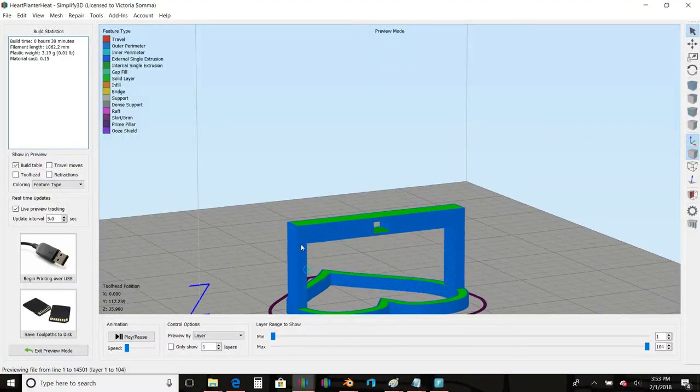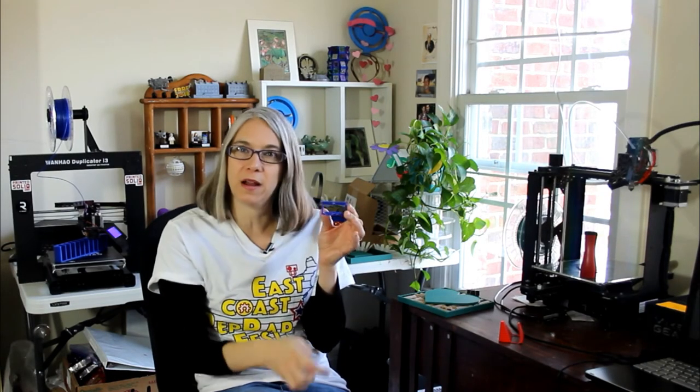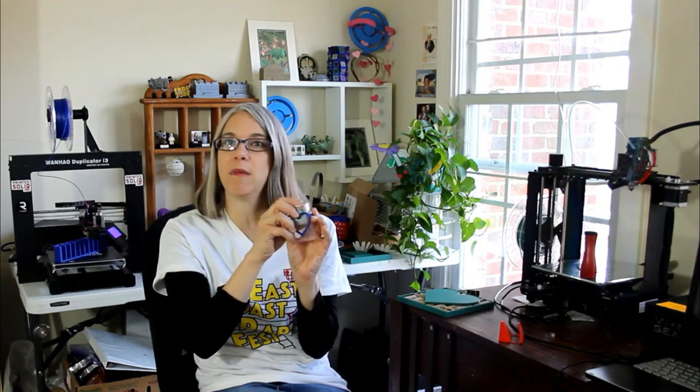With printing it, I actually printed it face down with the heart flush on the bed. That means I have to be very disciplined about my Z calibration to make sure that first layer is going to look nice — it has to be first-layer-porn worthy so it looks pretty on my wall. It prints the heart first and goes up, and then I just count on bridging to take care of my back support rail. There is a little bit of bowing, and it may be a happy coincidence, because when it comes time to put in my Tic Tac container, it holds snug even when I fill it up with a bunch of stuff.